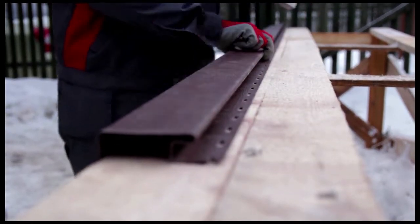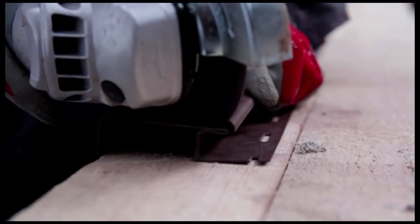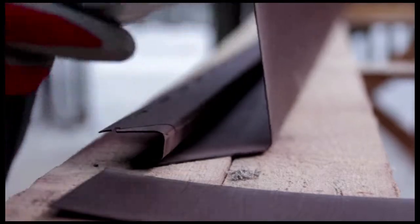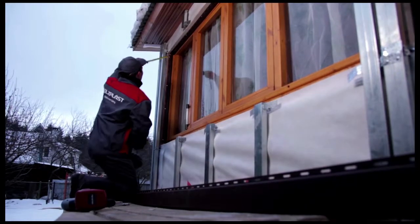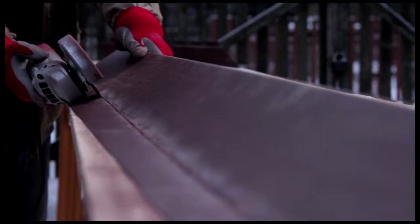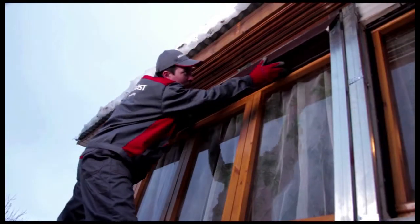Prepare the window trim for the top of the window. The length of trim equals the width of the window plus 2 widths of the trim used. Make cuts on both sides equal to the height of the trim. Bend the vinyl down at the cut to form tabs for water drainage. Adjust the trim width according to the depth of the window recess. After punching holes, attach the upper trim, locking its ends into the finishing strip. Prepare the lower and side trims in the same manner.